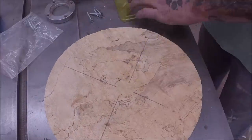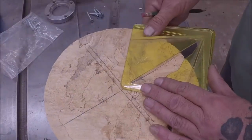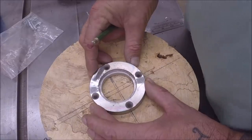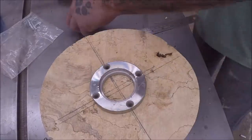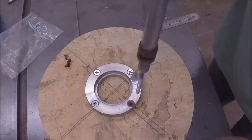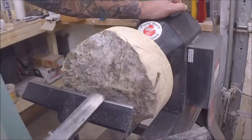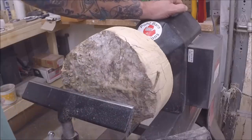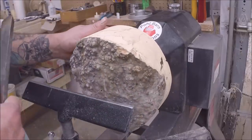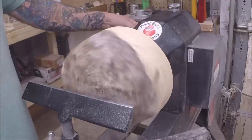Alright, we had a plan. I can make the scraper sharp, I can use carbide — this stuff tears out real bad. I can get a sharp enough edge on it, get it close to where I want. I'm going to use sanding sealer, the Minwax water-based sanding sealer. Seal it up, let it dry, and then just lightly get it to where I want it. There's a little vibration at 1250 RPM. We're going from there.